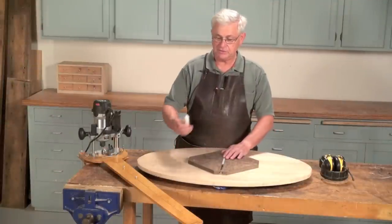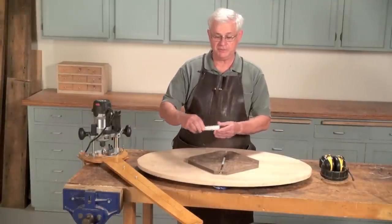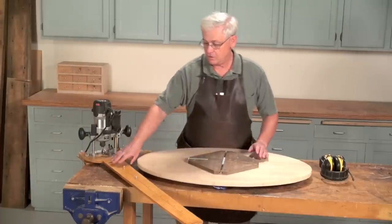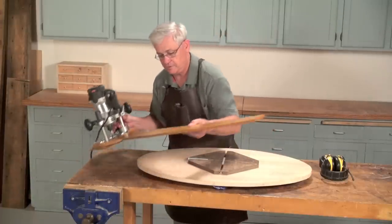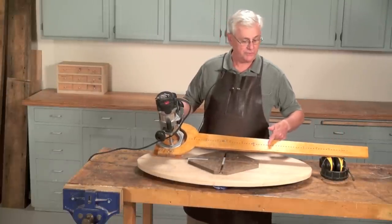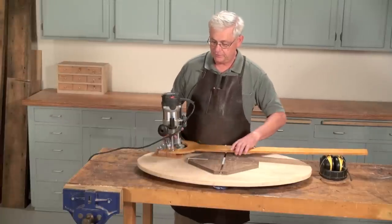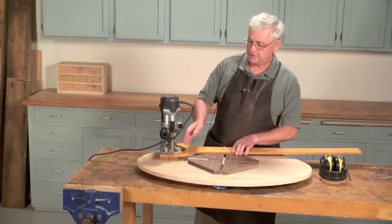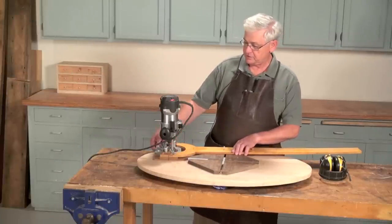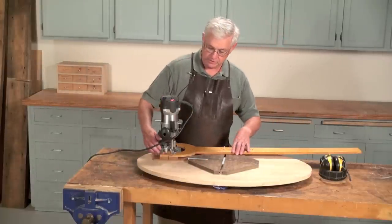The sliders are nothing more than a piece of plastic with a hole drilled and tapped in the middle to attach the arm. The arm consists of a series of holes so that you can create the size of the tabletop that you would want. The router is attached by means of screws through the base and up to the arm, tightened down and ready to go.